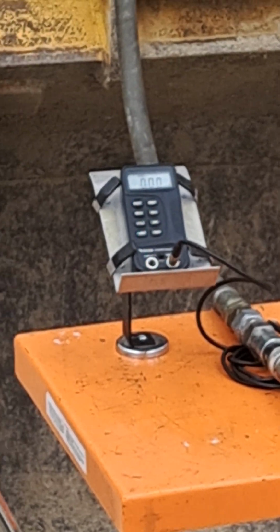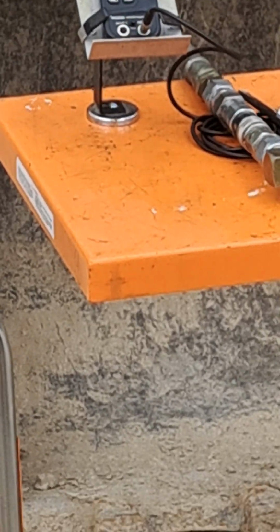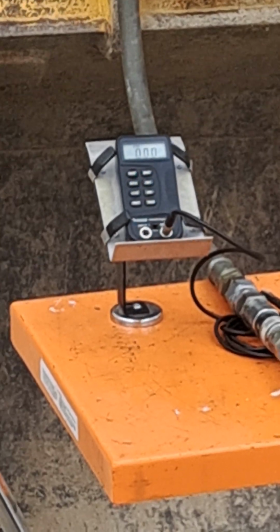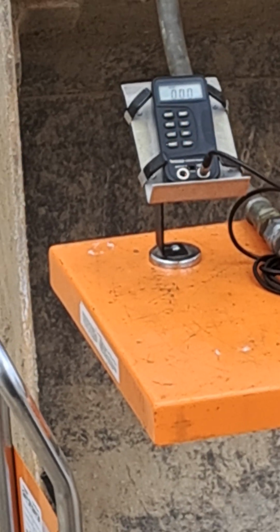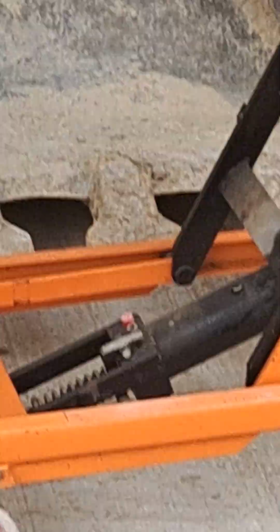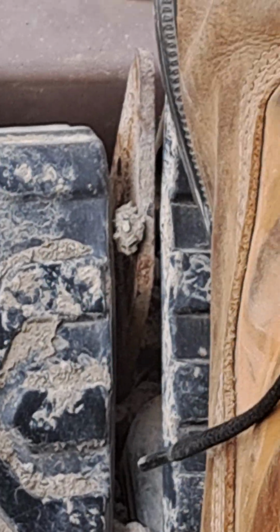So we looked at the two ball valves that are involved with one pump, two pump flow. Now we need to look at single acting or double acting. Right now our machine is configured for single acting, where the toe sends oil through the flow meter, through the attachment lines. Heel does nothing.